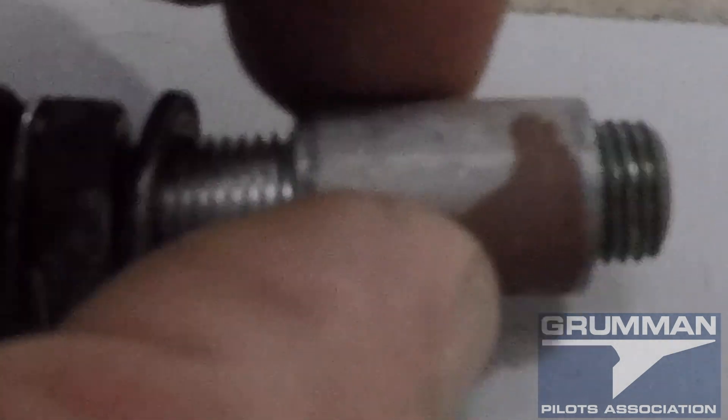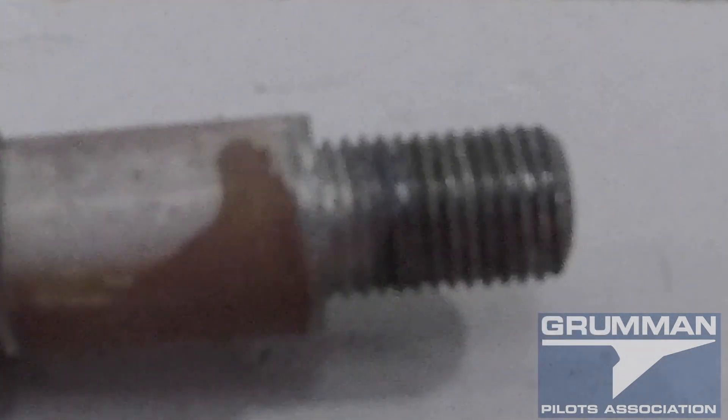This is the entire cowling latch pin assembly. This is the pin, this is the cowling latch pin spring, this is the grommet, then there's the adjustment screw. There's a standard AN washer, but this bushing — which goes up into the cowling where the pin screws in — a lot of people, when they take the old ones out, this falls off, gets blown away, and they never know it's gone.